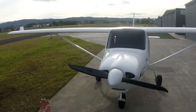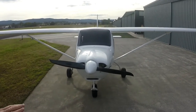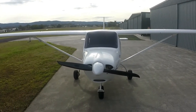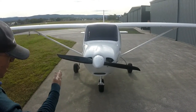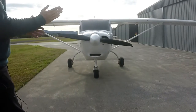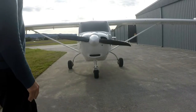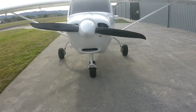While we're here, we stand back and just see how the plane's sitting — it should be sitting nice and square, not hanging down one side or the other, which is a good indicator there are no undercarriage problems. Somebody might have done some damage and it won't be sitting square. Check for a flat tyre. Have a look at the nose leg — when the nose wheel's straight, the leg should look as though it's sitting pretty well straight up and down. Check the tread on the front tyre and make sure it doesn't look flat.